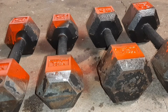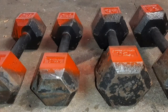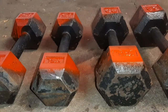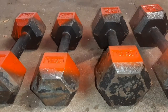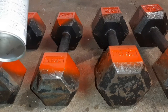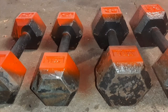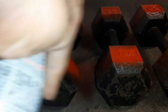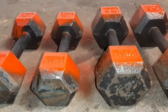Now we're going to want to let this all dry overnight. So we got our first coat that dried real well overnight — now it's perfectly dry. We're going to give our second coat. We're just going to go smooth and fast, keeping the paint moving when spraying. Get a nice second coat, and then we're going to let this dry until tonight — give it a good 12 to 14 hours to dry. Make sure it's really dry before moving forward.